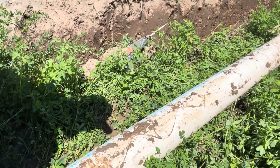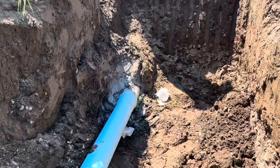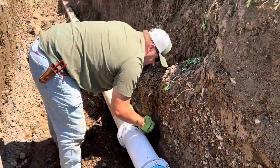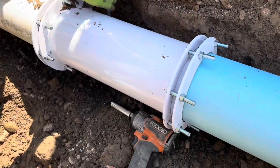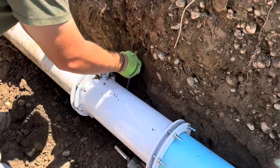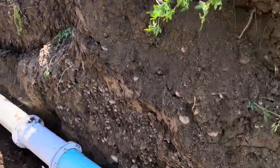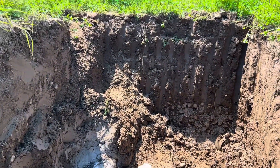I'm gonna say we had a shock wave that broke the pipe — no pun intended. Anyway, we're getting it fixed. Here's the main line, we got it all fixed. Here's the new chunk of blue pipe; it is 125 psi main line, six inch, goes down there. Trevor's just finished and tightened it up. This is the repair coupler — it's got a rubber gasket in there that you put on, then you just tighten it down and squeeze it. Now we got it all back together. We just got to bury it and turn the pivot on, watch the water, and make sure there's no leaks.